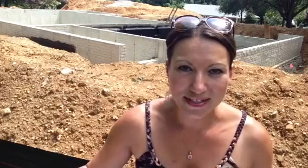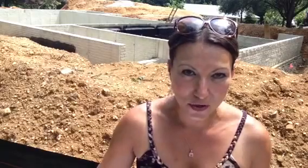There's the foundation walls behind me, and you see black, what looks like paint on those walls. And that is an application to begin the waterproofing process. And right around where the top of that black paint is going to be grade eventually. So that's where the dirt will be backfilled and it will form the ground that you walk on. Okay, you with me so far?